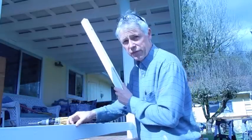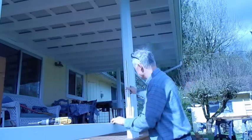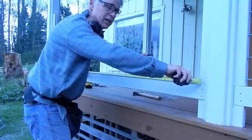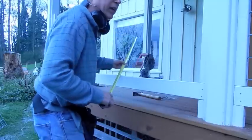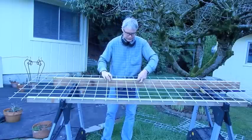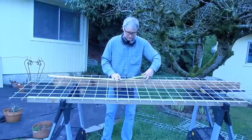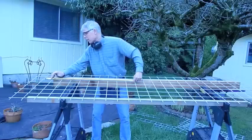The bottom and top plate are going to have the fat edge pointing outside. The side ones, the fat edge is going to be going on the inside. So I have two grooves that are 5/8-inch deep — add those together to get one and a quarter inch. Add 72 and three-quarter to get 74 inches. So half of 74 is 37 inches. I would say we put that in the center of the square, then from here measure out to the end. This is a measuring technique I use to make the panel look centered in the wood frame.